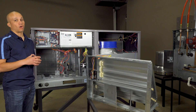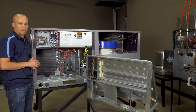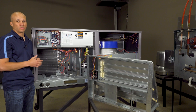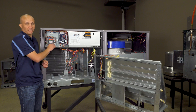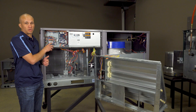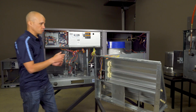From a control standpoint, you can have all kinds of different controls. I'm going to show you two types because they are by far the most common. This controller right here is made by Honeywell — it's called a Jade Economizer controller and it's probably the dominant controller you see on rooftops put in over the past five years or so. There's a whole display on here with about 40 different screens you can go through to configure it. It's one of the few that are code compliant. The Belimo Zip would be another code-compliant one, but you're not going to see a lot of those on existing units.